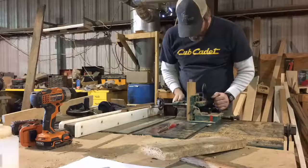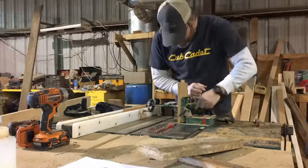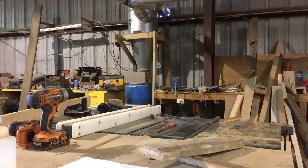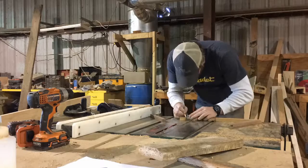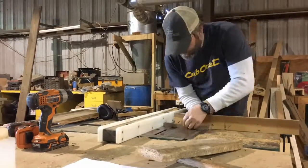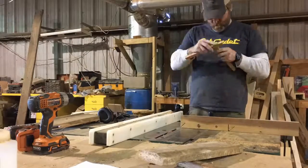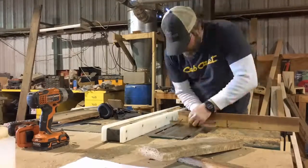Now I've got the walnut sanded back down to 220, so it's buttery smooth, and I have the shelves glued back into that dado, and I've started working on the watch holding piece of the catchall. I used the watch holding piece of the catchall as a way to show off some joinery, to make it a little more custom. So I used a bridle on the top and a lap joint on the lower one, and then I'm going to tie them together with a dowel.